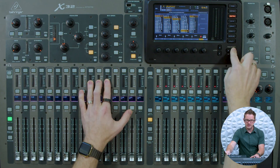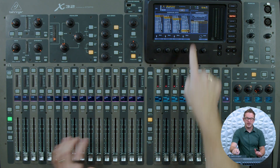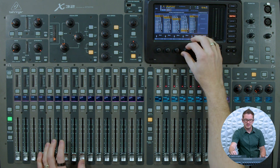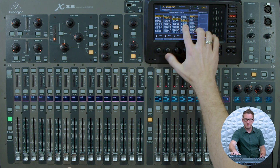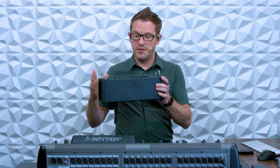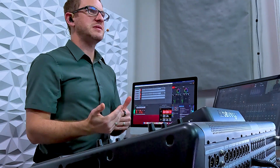If you're doing multi-track recording, there's one other place you need to make sure to change it: the card tab. Tab over to card and set this 25 through 32 down to AES 50B 1 through 8 — basically, if you're doing multi-track recording, make sure your card tab is matched to your input tab. Another benefit of the X32 is if you're not utilizing your aux ins, you can actually pull in your AES 50B inputs into your aux channels. Move inputs back to local and go down to AES 50B 1 through 6, and then when you plug in the stage box into AES 50B, inputs 1 through 6 will show up on your six aux channels.